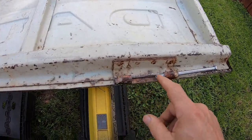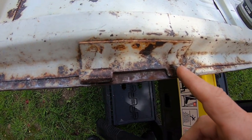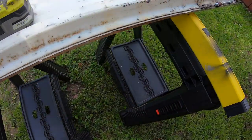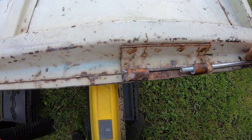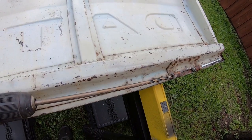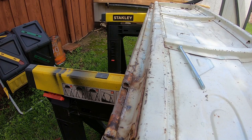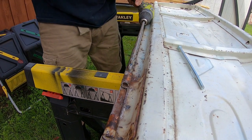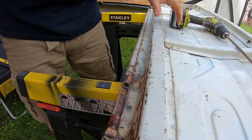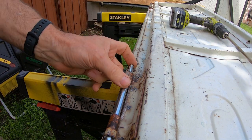This is how you fix the hinges. These hinges have a little dent right here to keep the pin in. When I bought the truck there was no pin — not sure what happened. You have to remove that dent to get the pin out, so maybe they rusted out or broke. I figured out it's like a 5/16 bolt — pretty close. You've got to get a really long drill bit, about 10 bucks. There we go — done deal. Now I can put a nut or a cotter pin or whatever I decide.